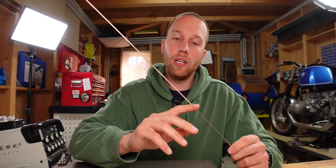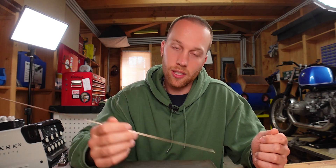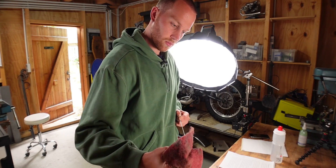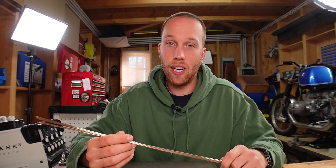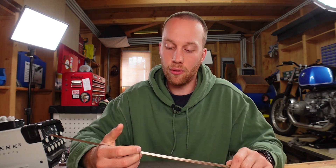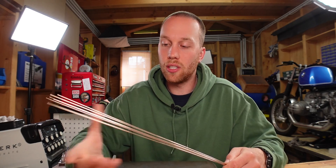It's also important that you properly clean your filler rod, because you don't want to introduce any contaminations into your puddle. I normally use a red Scotch-Brite first and then wipe with some acetone. A good practice is to only clean as many filler rods as you actually need for the joint you're working on — don't batch-clean the whole package and then forget about it. Just clean as many as you need and then clean new ones as you go along.